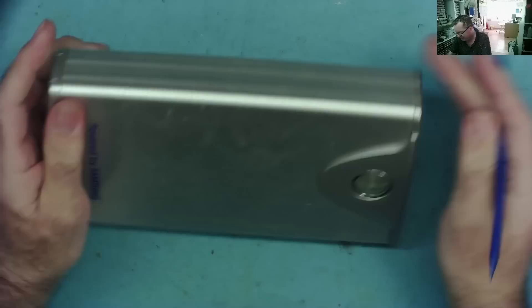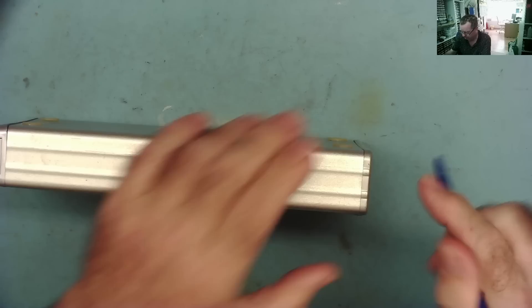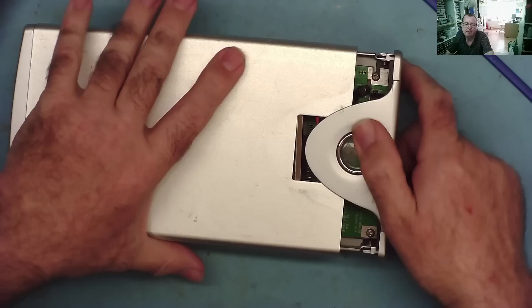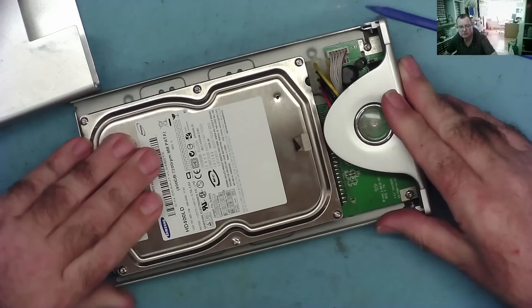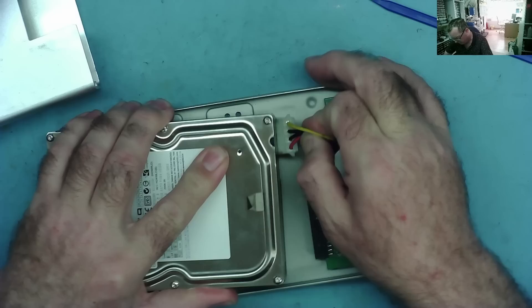Normally speaking, how I would fix this is I would open it up, take the hard drive out, attach it to the computer on a SATA cable and power it up that way as an internal drive. But I'm not actually going to do that first because in fact this is not a SATA drive — this is an IDE drive, full of old important valuable data and photos.